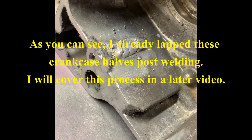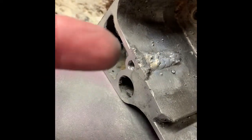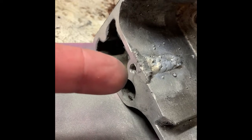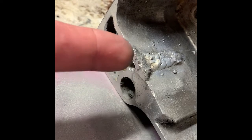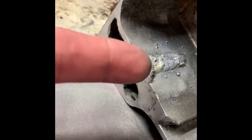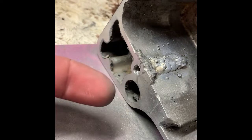This is pretty close, I can see where I'm at. It looks pretty good — if I run my nail up it, it doesn't catch on this side, but it still catches just a little bit on this side, so I've got a little more to go there. I did add a little bit more weld right here because I need something for the RTV to seal against, otherwise oil is just going to leak down into that screw hole and out.